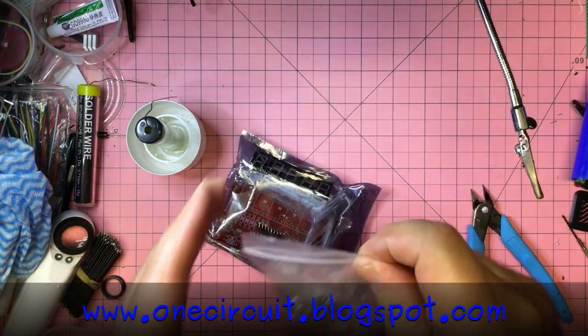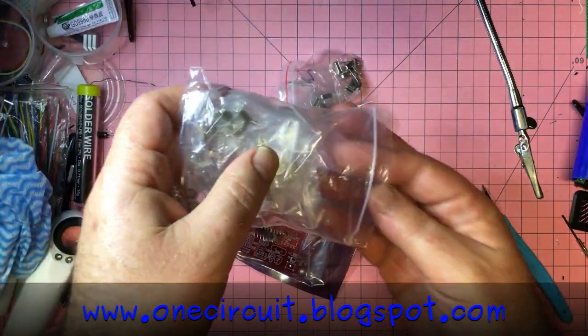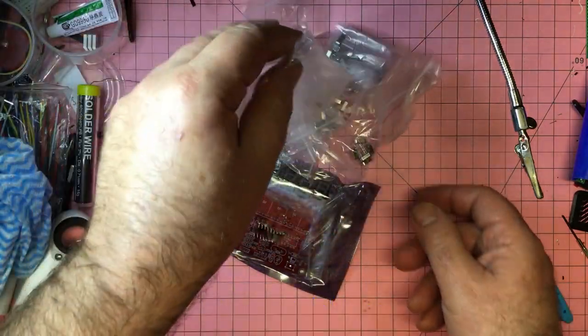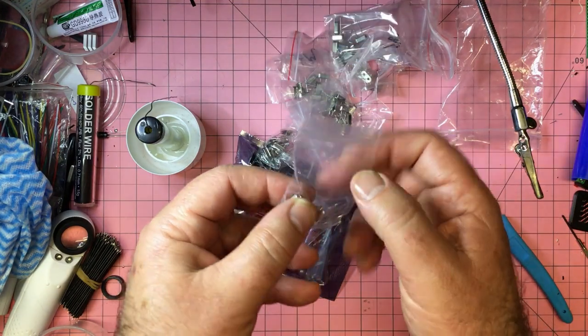So I've been making a few projects recently with external crystals, experimenting really. I mean, mainly because the timing for an internal crystal in AVR is not always that accurate for some projects.